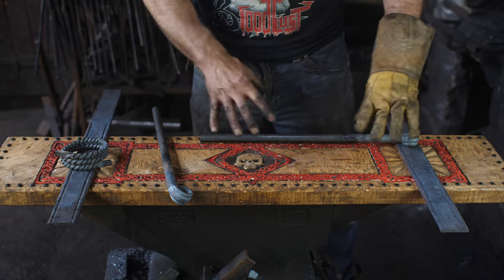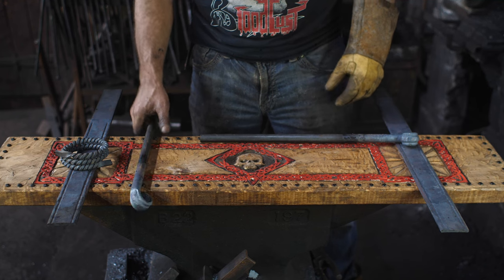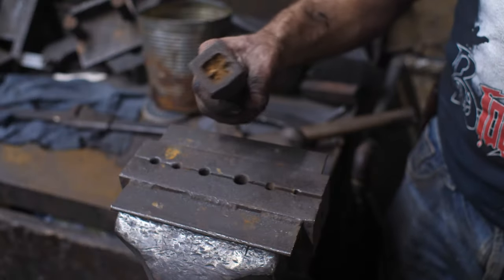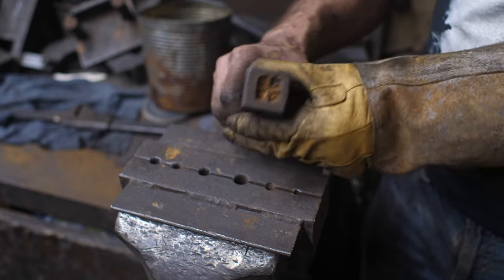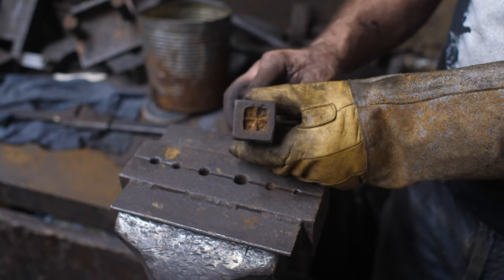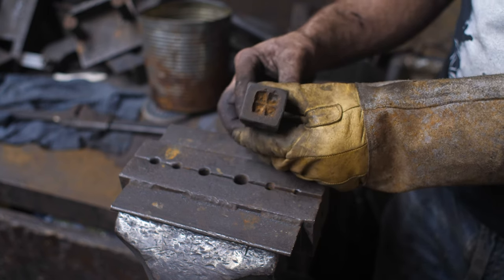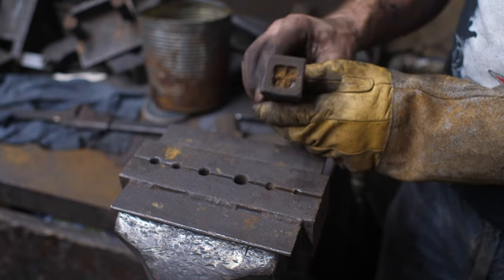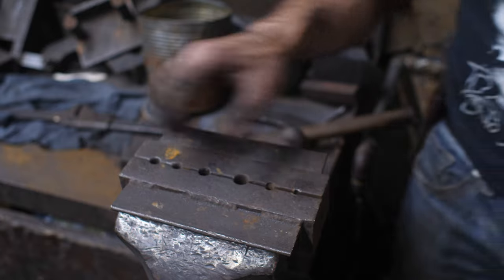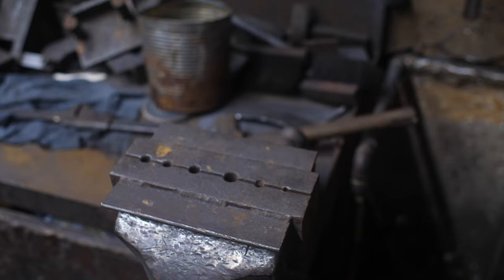I think maybe I'll do that now while the rest of this stuff is still cooling off, and then we can get it chopped up. So let's do some decorative bolt heads. While we're in the mode of using tools from days gone by, I pulled out this little bolt header that I created probably 20 years ago, and I really haven't used it much in the last 15 years. So it's all rusty. Let's see how that works. I've got some square head half inch bolts, and I'm going to be putting them into my upsetting block there, and let's see how this goes.